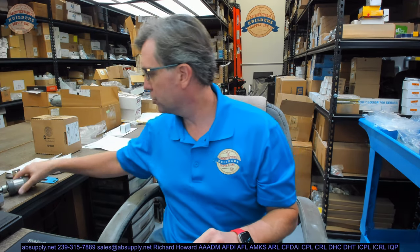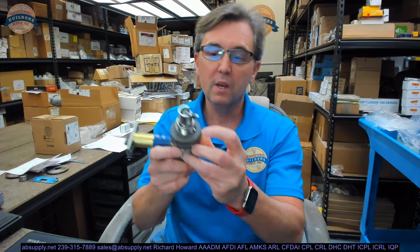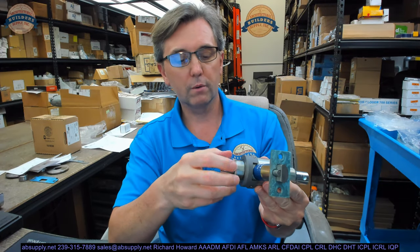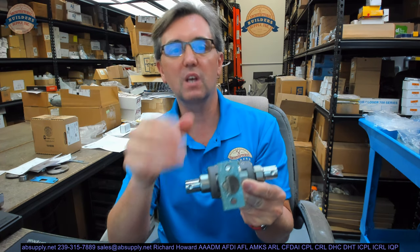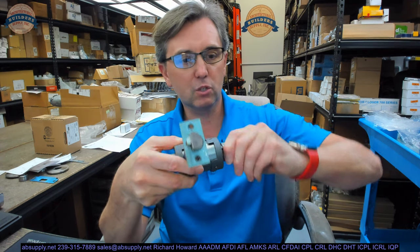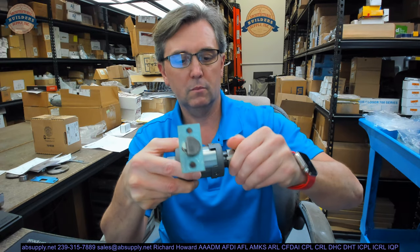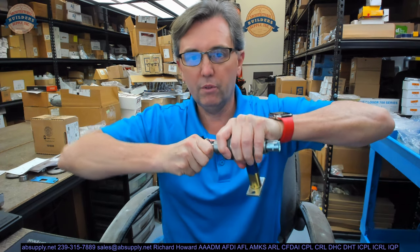Let's take a quick tour of the unusual componentry of this type of lock. When it comes out of the box, the latch bolt's captive. What do I do? There's a pin in here that you need to remove — the inside, the outside sleeve assembly is what it's called. In order to do that, you'll rotate this threaded collar and you'll be able to pull that out.